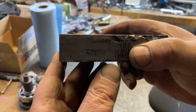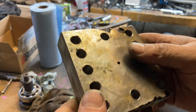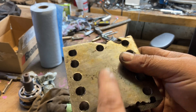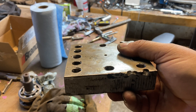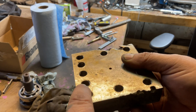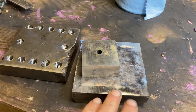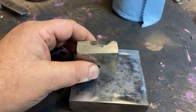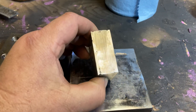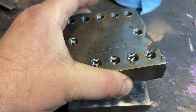We'll put it like this so the surface where the bits are sitting will be here — maybe we'll round the edges off. Now we're going to cut another plate exactly the same, but only put a hole through the center — that will be the bottom that sits on the cross slide. I already cut the piece out; I just need to drill the center hole, because you don't need bolts going through that one.